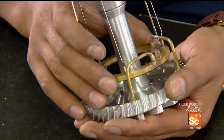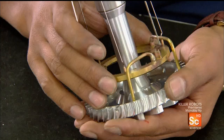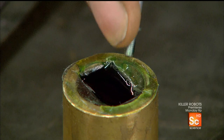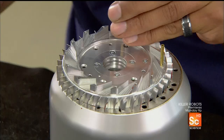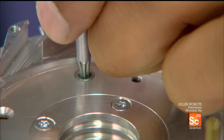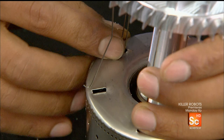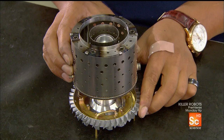He inserts a hollow cylinder into the base plate and then presses a fuel distribution ring into the plate. With the parts correctly aligned, he places the assembly in a metal stand, dips screws in a thread-locking compound, and drives them into threaded slots in the base plate, securing and cementing the base plate assembly. He then holds the base plate unit above the combustion chamber while inserting the tiny fuel delivery tubes into the chamber, flipping it around to slide the tubes further inside and complete the job.